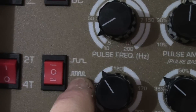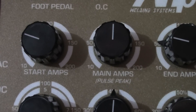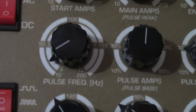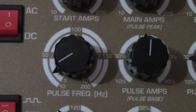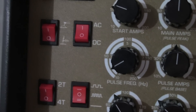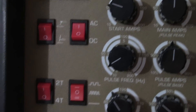If you want a higher pulse setting, select the middle rocker position and your pulse can go from 10 Hz up to 200 Hz. That range up to 200 Hz is a change in this 2016 version — it was lower on previous versions. TIG/STIG and AC/DC are pretty self-explanatory.